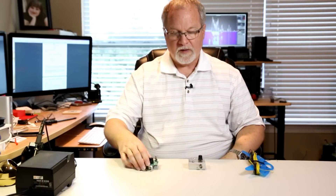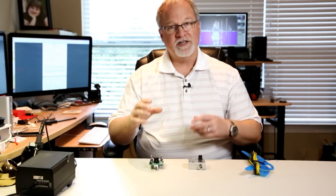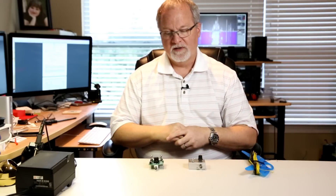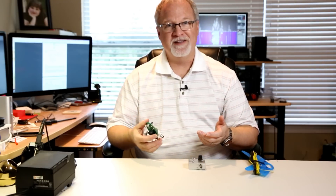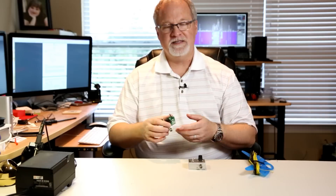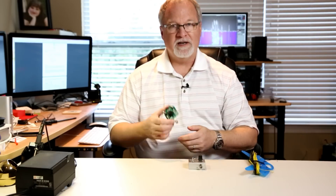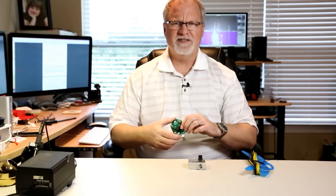So I took it out in the field and I'm going to show you the video. I used an antenna analyzer when I tested this so that I could show you the SWR before I started messing with it, then show you the LED going out and the SWR after the LED goes out, which is improved. The only thing to note is that if you use this with an analyzer, it puts out very little power, so the LED doesn't glow very brightly during that test. But for a normal radio, even the Mountaintopper I had with me that day, it makes the LED glow very bright. So don't let that dim LED in the video scare you away — it's just like that with the analyzer, not with transceivers.